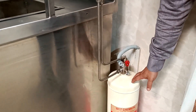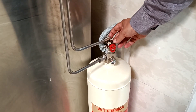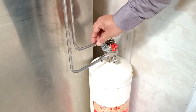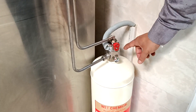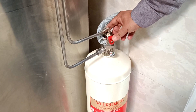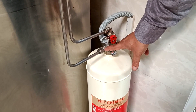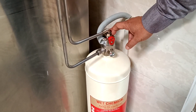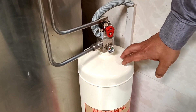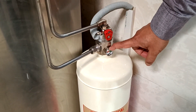On top of the shell is the indirect low pressure valve. The ILP valve is fitted with a heat sensing tube on the head of the valve. It has 2 ports available for output — whenever the valve is activated, the agent can be released from one or both outputs. On the ILP valve we also have a pressure gauge, which indicates the pressure within your shell, which is going to be 19 bars.